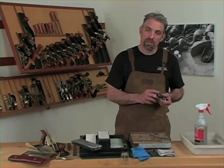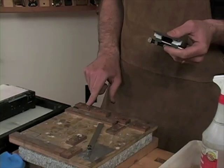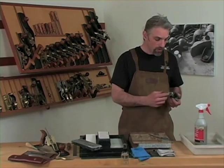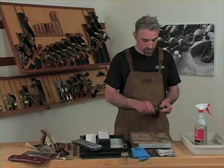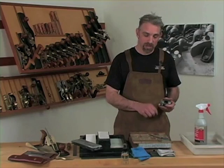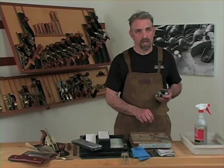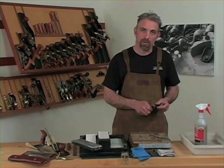You'll find that if you measure these angles every time for sharpening, you never get the same angle twice. It's a really good idea to make some stops for each different angle that you're going to be working with. Once you've determined the angle, either with a measurement or with the protractor, make a stop for that distance. The next time you want to sharpen a blade, you drop it into your jig, go to your stop, and you're going to be getting the same angle that you got the first time. This doesn't necessarily mean that it's exactly 30 degrees, and that's okay — if it's 31 degrees or 29 degrees, that's not a problem. The important thing is that you're reproducing the angle you had the first time you sharpened that blade off that stop.